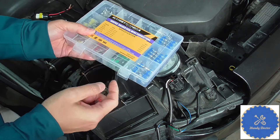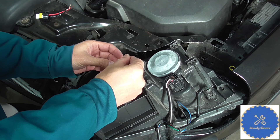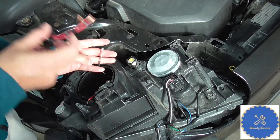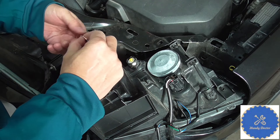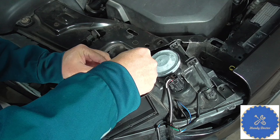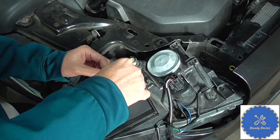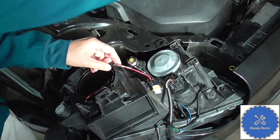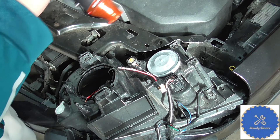We'll do one at a time to make sure the wires are together. We're going to slide it all the way in, and now on this side we're going to get the red color and also slide it in — again making sure the wires are together so it will go in easily. Now we're going to use the heat gun to heat it up, and the solder will work and also insulate it.